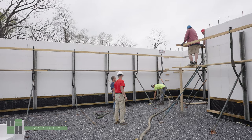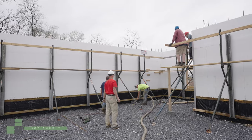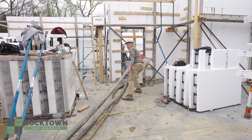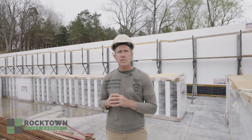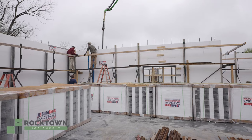It takes more effort and more time to use a line pump. They're a bit slower, but very versatile in where they can reach. Boom pumps are great to use in these situations because of their reach and low effort on our part to control where the concrete goes.